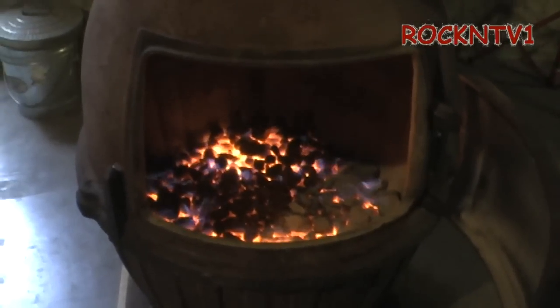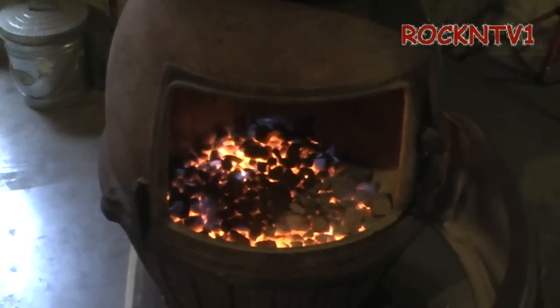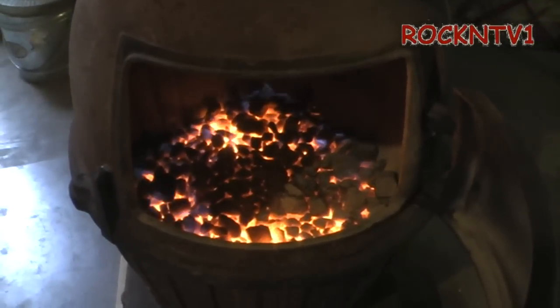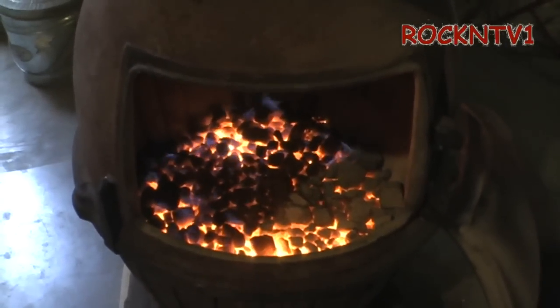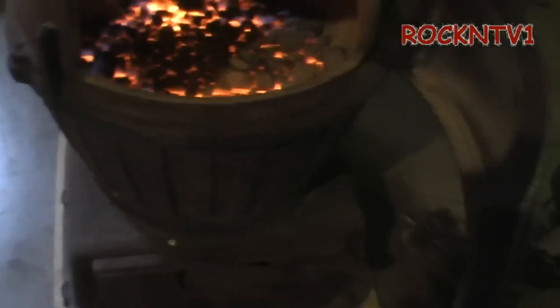For you guys — I watched some videos this morning of guys putting these little tiny potbelly stoves in their campers and having to get up at 3 o'clock in the morning before they're freezing. Buy yourself a bag of coal, throw 10 to 15 pounds of that in there, and them little stoves — you'll be done. Check out my coal stove noob video. With the settings on here, you can see I can grab that thing — it's about 5 to 10% open up there, and right now it's about 85% closed on the bottom. I can tool that back a little bit more and just let that thing idle all day.